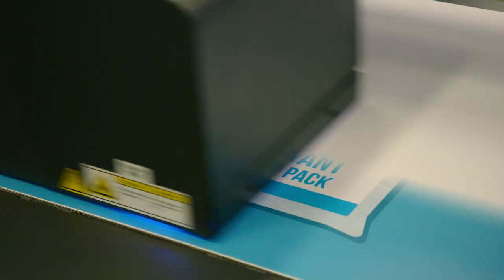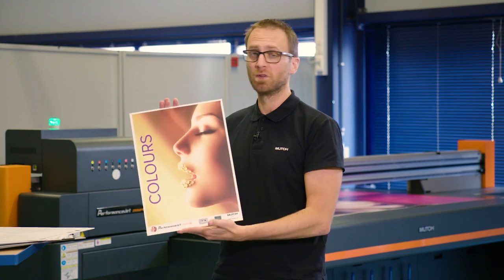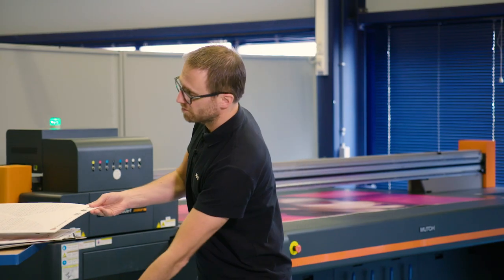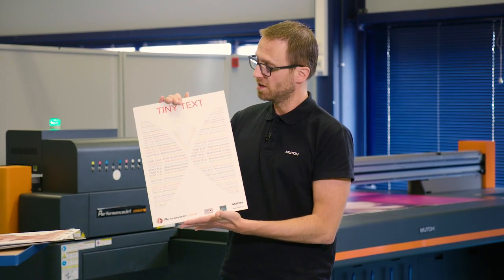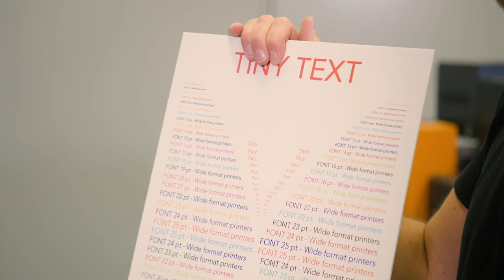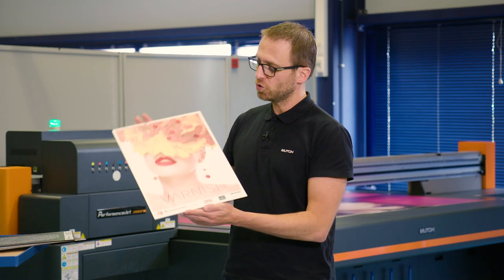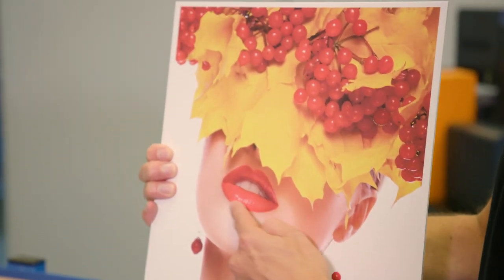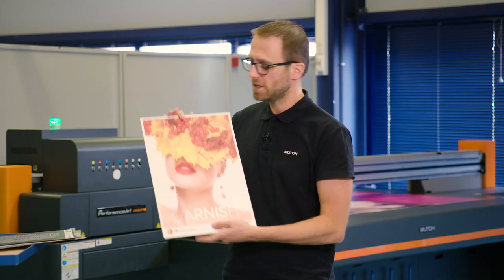The six color machine gives us a vast array of possibilities. We can start with normal fast color printing in CMYK only, which has very high precision thanks to our Ricoh Gen 5 heads — Arial type 5 text is perfectly possible in high quality. We can also go from normal color prints to a color mixed with varnish for a nice graphical accent, a style which you can't do with plain CMYK.